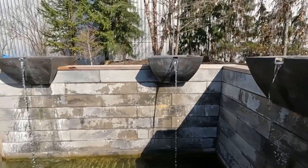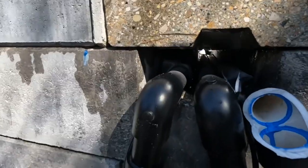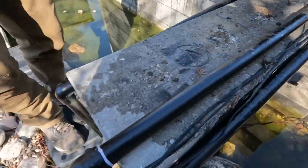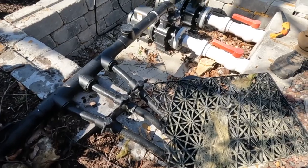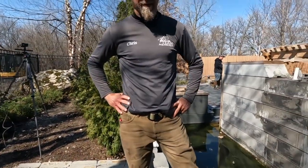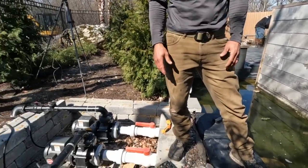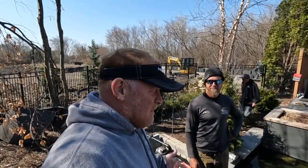When I made the lids for the top of the bowls, there was a little part right at the spillway that we cut out or notched out to help them spill into the little sun deck area of the pond. They just didn't quite fit, and a little bit of water got down inside and got into the plumbing. Fortunately, the bowls themselves didn't crack, but when that water drained down through the plumbing, it siphoned back and froze in some of these areas. I guess I'll take credit for the dumb mistake. I think the other thing we'll do is - you can see we have these solid lines that run through here, two solid lines, and they tee off of the main line that feeds the wetland. We've got three ball valves sitting right here. I think what we'll do this year is put three unions right here - we can just disconnect these whole things, that way if any water were to get back in the bowls, it'll drain back out by gravity, and then we can just hook them back up in the spring. Even after all these years, we're still screwing stuff up, and hopefully with our mistakes, you guys don't make mistakes.